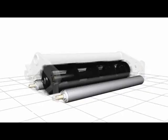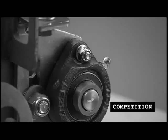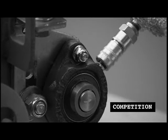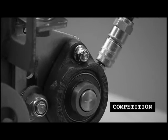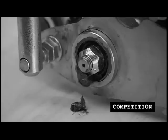With so many adjustment points, even a small bumper drop of the cutting unit can throw the whole unit off, sending a technician out to the course time after time to fine tune. Reels and rollers must all turn evenly and smoothly, so frequent greasing of bearings — as required on competitor's units — compounds the problem. Grease can purge out the bearings and damage your beautiful short greens turf.